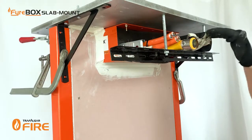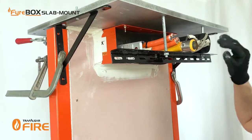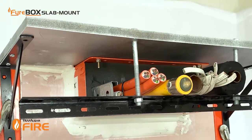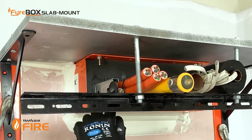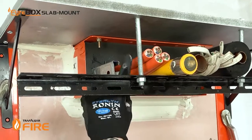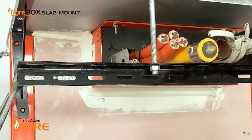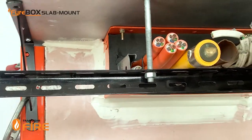At the end of the day you don't want to see any daylight through the box once you fit the foam plugs on both sides. If you do have a cable tray running through the firebox you'll notice there are some lips on these cable trays where you can see straight through, so it's important to plug them up with a bit of foam or our acrylic or intumescent sealants.